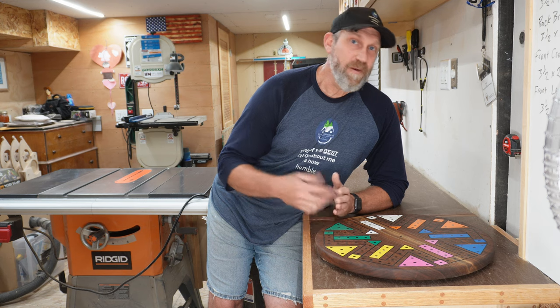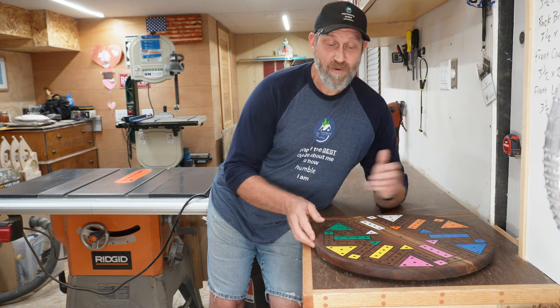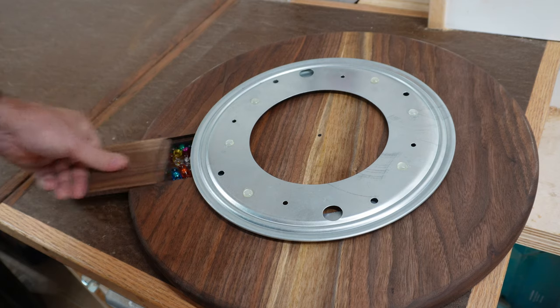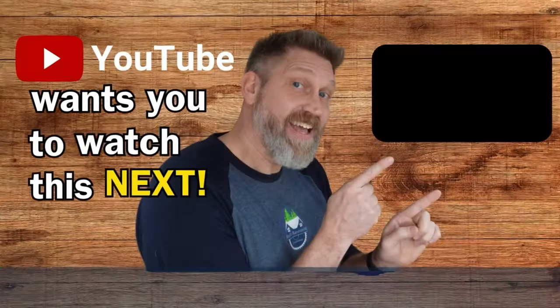The shellac needed to be sanded back a bit with a white scotch-brite pad, which is the equivalent of 600 grit sandpaper. Then it was safe to apply a top coat of wood wax. Despite all the trouble I had, these boards turned out really beautiful — truly unique with the magnetic game pieces, the onboard storage, and the lazy susan. Thanks for watching.